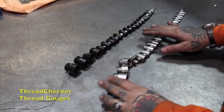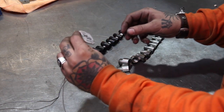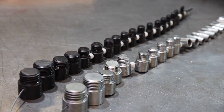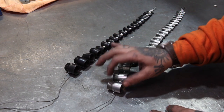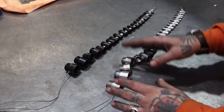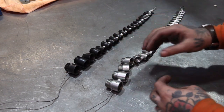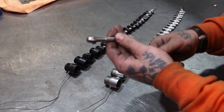These are thread checkers — quite literally the brand, the Original Thread Checker from the States. I got these from a local bolt shop. I was looking to establish a range of nuts and bolts to use as standards for the threading work I do a lot of. They suggested these because they are quite well made and they're to a tolerance of what a hardware store nut and bolt would fit as. A lot of the times when you're doing hardware for something, it's not a precision fit, it's not supposed to be a machinist fit — it just has to be a standard bolt or nut from the hardware store that you can thread directly onto the part you made.